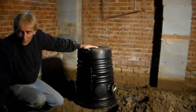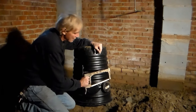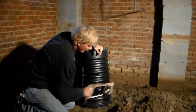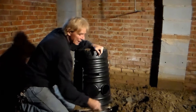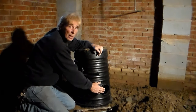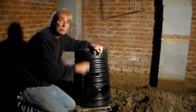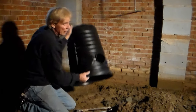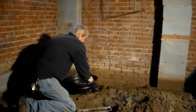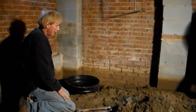We're ready to set up our sump pit. First thing we do is turn it upside down and cut this little nipple off using a hacksaw. This will allow the inlet line from the gravel perforated pipe — the footer tile — to come down into the system and into the pit, and the pump will lift it up and carry it away. Paul's got a really nice pit hole dug — just need to clean it out and it's ready to go.